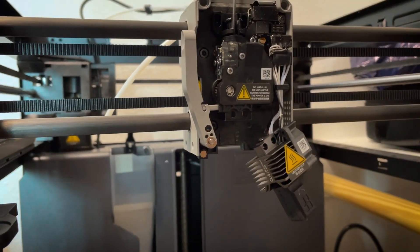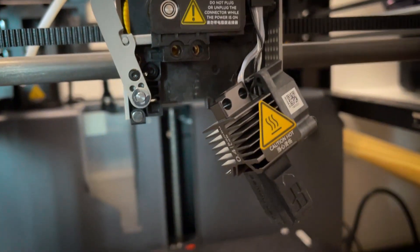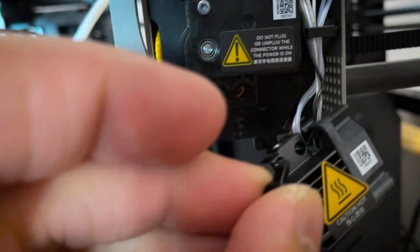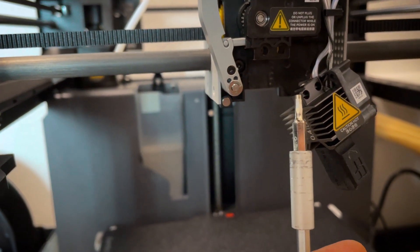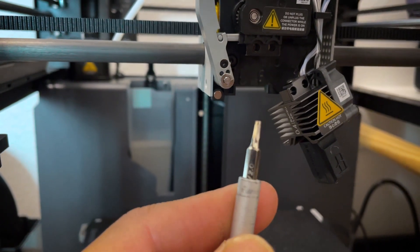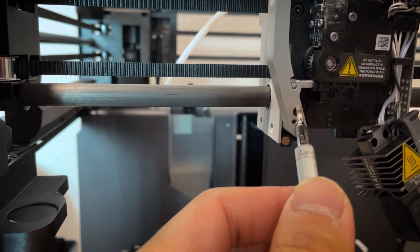As you can see right now, I already took off the magnetic cover — that's over here. This connector just pops off right over there; you can see there's a missing connector, so that's super easy to take off. To take off the hot end, I took off these two bolts — you can see one right there and they just go through the holes over here. All you have to do is use whatever tool they provide you; for me I have a 2.0 hex tool that got it undone. The next step is to use a 1.5 hex and undo this bolt here.